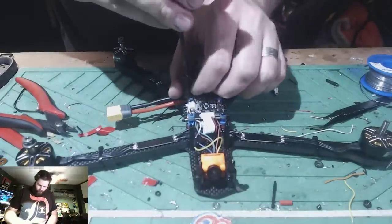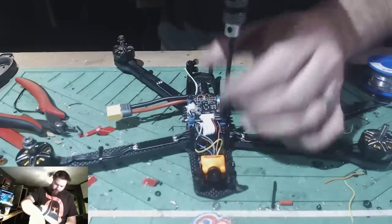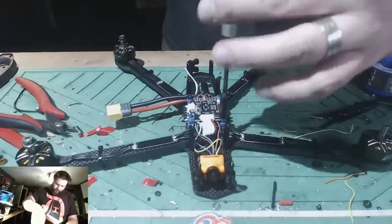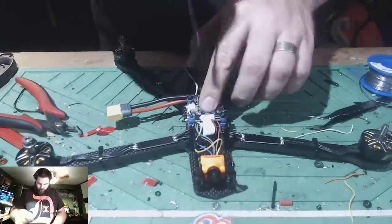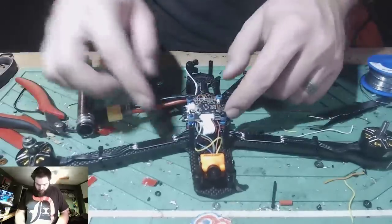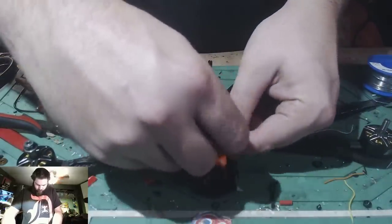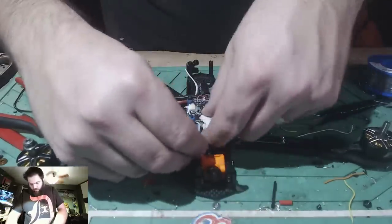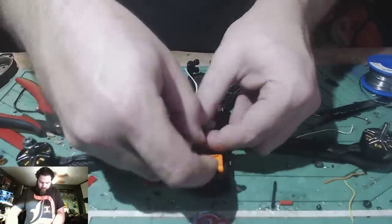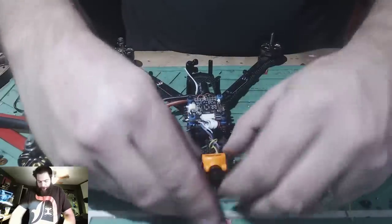Yeah, so what's your setup usually? My setup is normally like Hobby Wing G2 stack. All my freestyle rigs actually have a 2306 1600 kV Hobby Wing motor on it, and they're just super smooth. Even the big guys, or you want something bigger for the big guy? No, same ones on my 7-inch, actually.